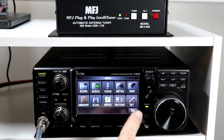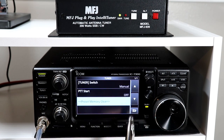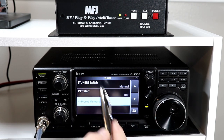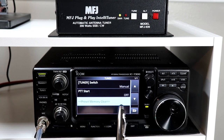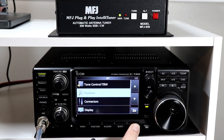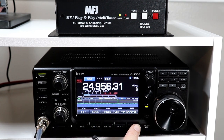When using an external tuner designed to work with ICOM radios, that tuner connector provides power to the tuner. There's no difference in the 7300 menu selections. If I go to tuner here we have the same tuner switch: manual, auto, push to talk, start, off, on — and those function the same way as they do with the internal tuner. The preset memory clear doesn't really do anything for an external tuner; that still clears the internal tuner memories inside the radio. But you don't need to do anything different on the tuner menu, and there are no other menu selections for activating or telling the radio that it has an external tuner.